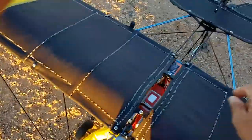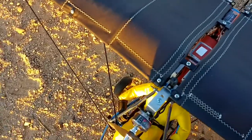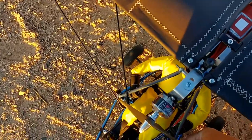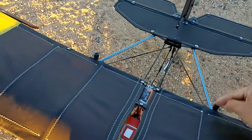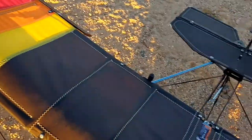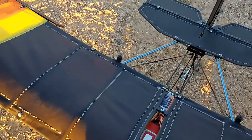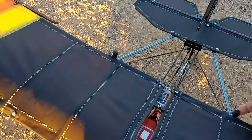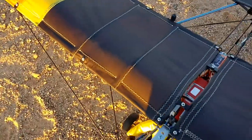These are actually 3D printed parts, and the way these are done is they have a star lock nut underneath, which really grips onto the 3D printed part, but also the 3D printed part has a through hole which is slightly smaller diameter than the screw, so it has double grip on the nut underneath the plastic part and also on the plastic part itself.